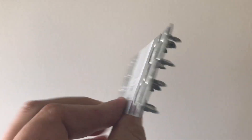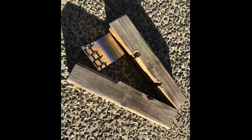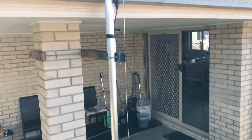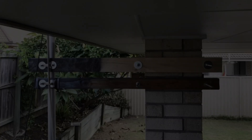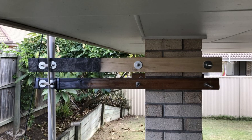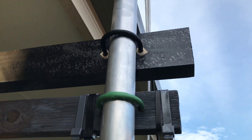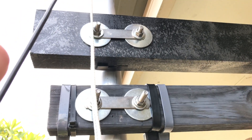I wanted this timber strengthened because after I brought some nail plates I split a part of the clamp. Instead of using a U-bolt the first time, I used another bit of treated pine to clamp the pipe. That was okay for something a meter off the roof, but when it gets to something that's probably six and a half meters high, where things can be dangerous, I obviously wanted it a little stronger. So this isn't even the finished result — I want to move to something like box section aluminium that will never rot. I've also replaced the clamp done with treated pine with U-bolts and some mud flap washers to spread the force over a decent area.